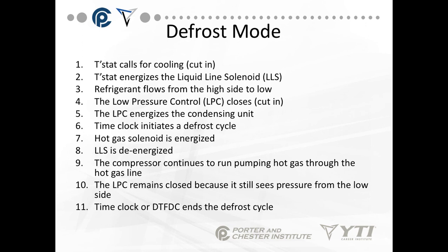We continue on with cooling. Once the defrost cycle is ended, the liquid-line solenoid is reopened if we have a need for cooling, and the hot gas solenoid is de-energized, which closes it. So what you want to do is go back through this and totally understand the steps of the cooling and defrost modes in these systems. In the next video we're going to take a brief break from defrost and talk about some additions we need to cover on low temperature and refrigeration systems.